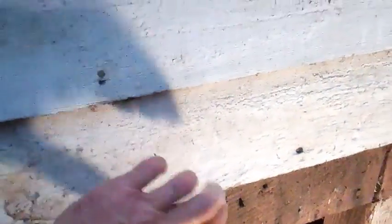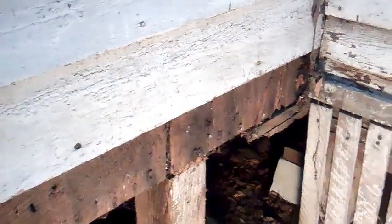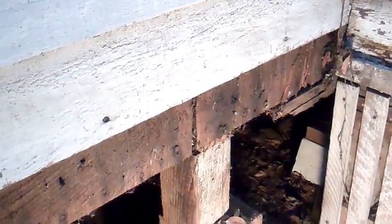With the siding on the outside of it, the cedar or redwood siding. So the wall from the outside to the inside of the house is about an inch and a half, 2 inches thick. There's no air gap. There's no 2x4s. It's simply 1x12s nailed along the bottom and then 1x12s nailed along the top. So that you can actually flex these walls, which it's survived every earthquake so far because it's so flexible. There's nothing rigid to break and crack.